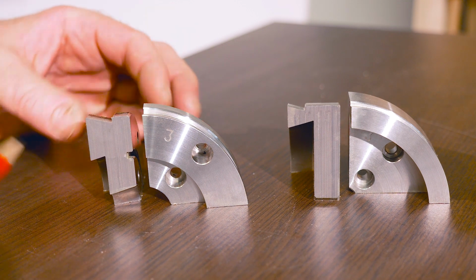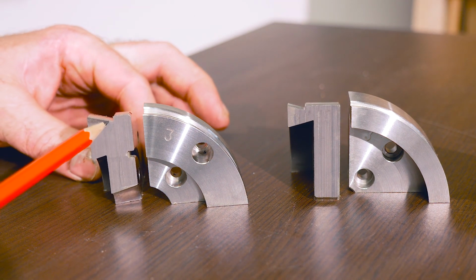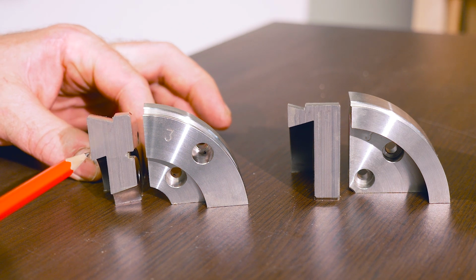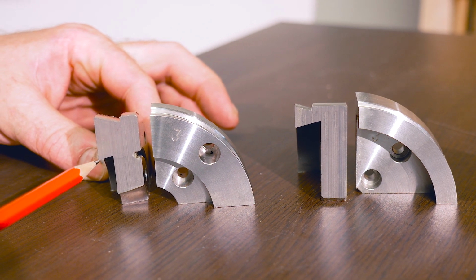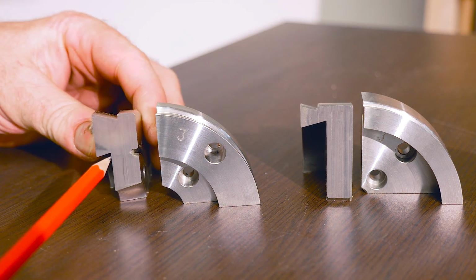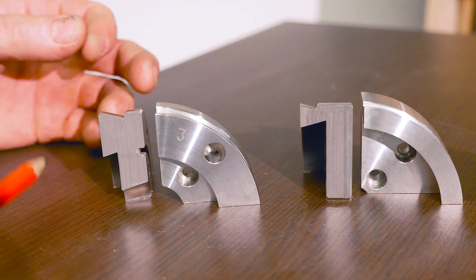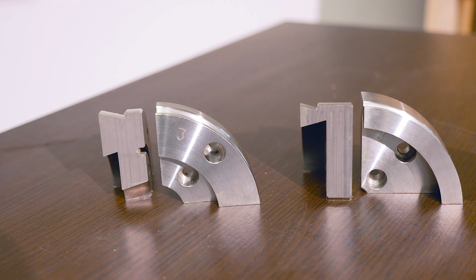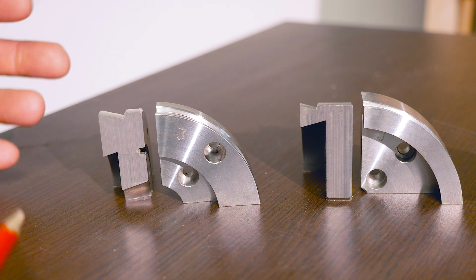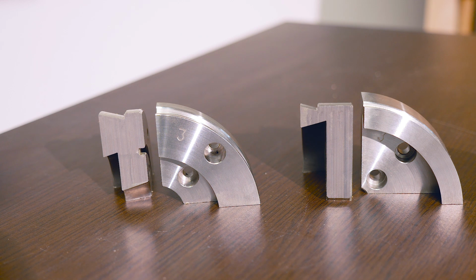So within the range of chuck jaws, there is a vast range of different dovetail jaws. So we have a dovetail edge on the outside, flat across the top, dovetail on the inner. This shows the profile shape, quarter quadrant. This is giving you an idea of where the dovetail is, inner and outer. There's a variety, like I said, of different sizes, which allows you to accommodate most sizes that you might want to turn. No jaws are ever going to do everything, because you're trying to aim for that true circle as much as you can to get maximum grip.